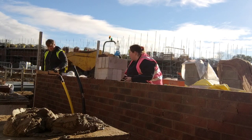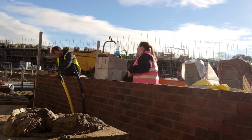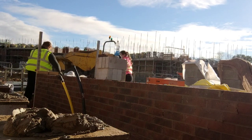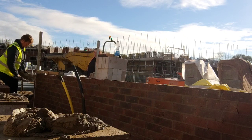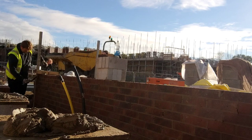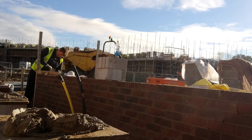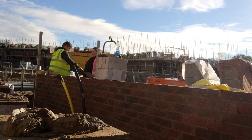When these bricks get really wet and dark, you need to use really stiff gear — uncomfortably stiff — and go back to a traditional pick and dip. If you watch Andy from Bricklaying Worldwide, he did a video called 'Pick and Dip with Full Joints.' I've tried doing something similar — basically spread for one, quickly smash a perp joint on it, and next one. It's easy enough to do if your gear is stiff. With stiff mortar you can actually get these bricks up, though it reduces your speed a lot.